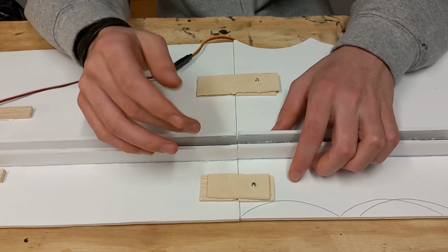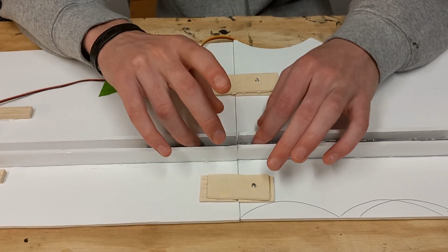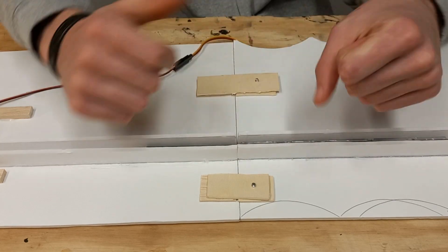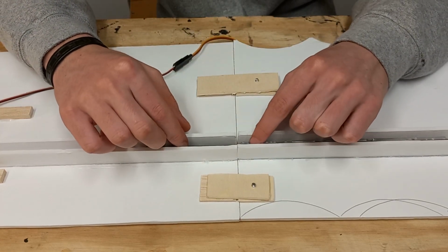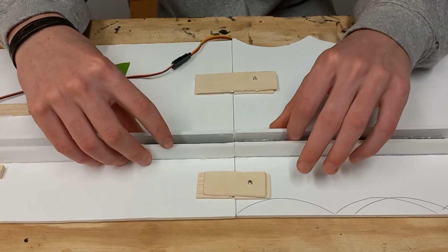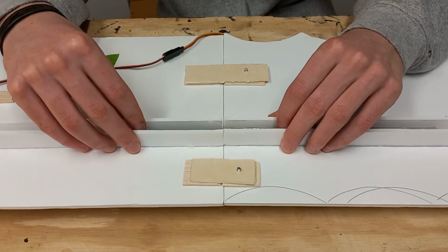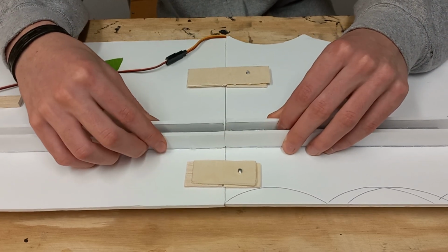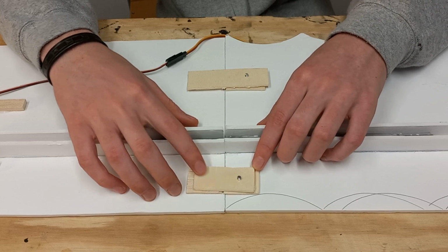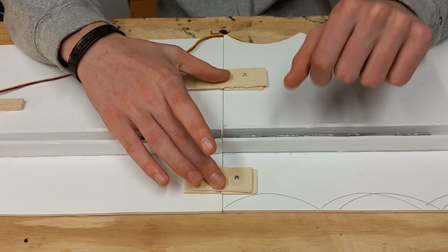So the way that this goes is very simple. I have a large carbon fiber tube, a small carbon fiber tube, and the two go together, so I have a really rigid structure. This is glued to this bar, this is glued to this bar, so it doesn't have any play, very, very rigid. But I also added, just to keep everything held together in flight, 2 screws.